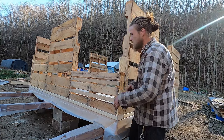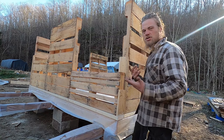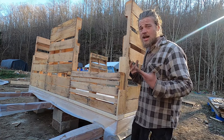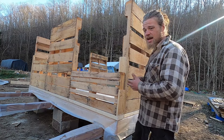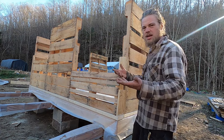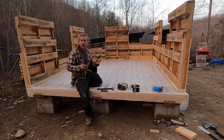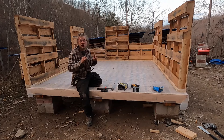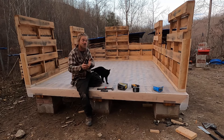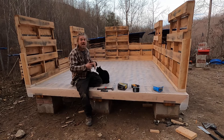All right, so now I'm going to shim up the walls, make sure they're all lined up perfectly. I've put a couple nails in it. We're going to screw it down, but I might do nails first just in case it rains. I don't want the screws to pull out or even worse to pop. With it being oak — it will win. The oak will win over the screw if there is enough swelling force, expansion force, from it getting wet. So I'm thinking nails with a couple screws just for now. I went around and tested all of the different dimensions. None of these dimensions are perfect, but I want them reliably imperfect — so instead of a quarter inch or a half inch on one particular side, let's split that into a quarter inch on both. Now that we're happy with it, we just got to run around and put some nails in that baseboard connecting the walls to the floor.